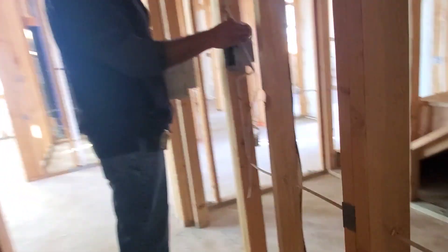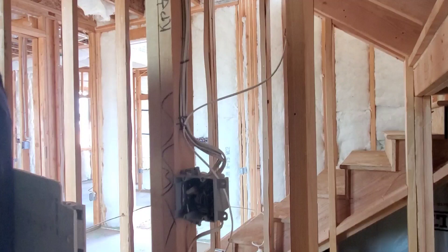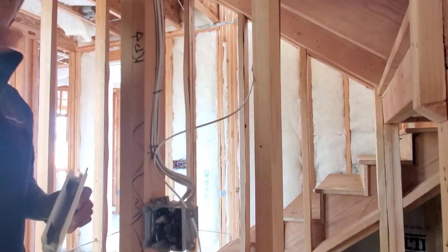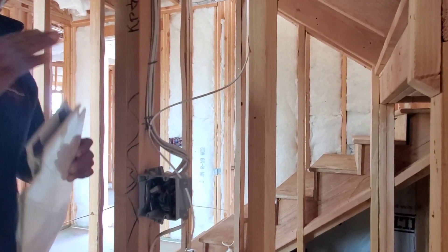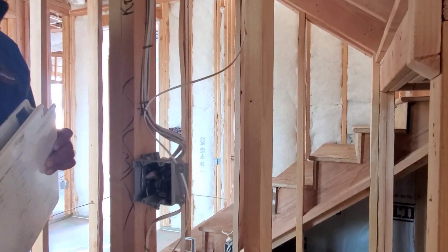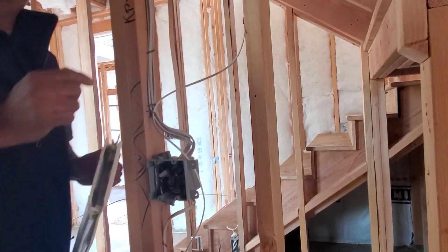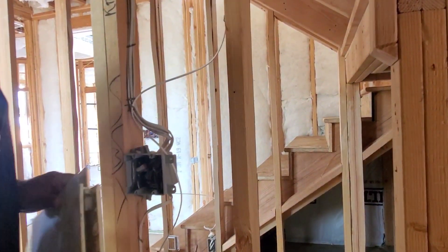You have outlets all the way around the garage, plus power for your garage door opener and a free wire already for your safety sensor beams. On center of every garage door opening we install solid wood blocking so no matter where the rail is placed it hits something solid. The red caps in the ceiling are your fire sprinklers. There's also a data wire wrapped around a nail — once we sheetrock you'll never see it again. Its purpose is for a future wireless alarm system — you can put your keypad here and a motion sensor over there so an accidentally open garage door will trigger the alarm.